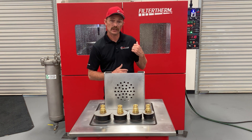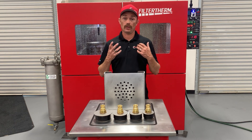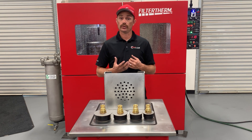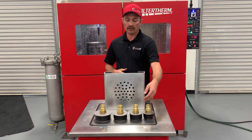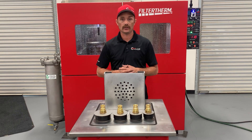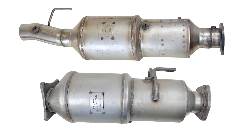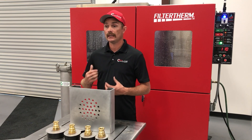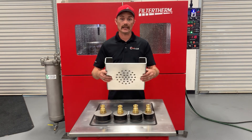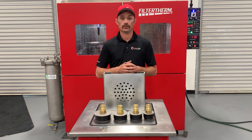The Filtertherm Aqueous machine services a wide range of DPFs — light-medium-duty, heavy-duty, and off-highway. In order to accommodate all those filters, we'll need some adapters. The adapter package from Filtertherm allows you to clean closed-face filters ranging from 3 inches up to 5 inches in diameter. Pick the adapter that best suits your needs, insert it into the DOC or DPF, and tighten it down. For odd-shaped DOCs and DPFs, Filtertherm's adapter plate allows you to set side-inlet, side-outlet DOCs or SCR catalysts flat on a level surface, ensuring a good clean surface area for those particular filters.